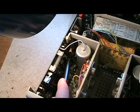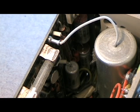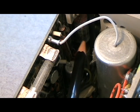I'm also going to replace this capacitor up here just because it's kind of dried out and not working very well. Here's a close-up view of those capacitors — these are 40 microfarad 35 volt capacitors, and this one is a 100 microfarad 35 volt capacitor.